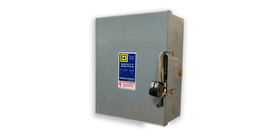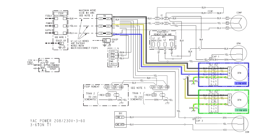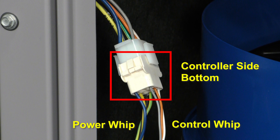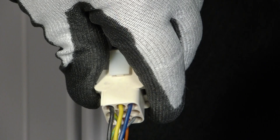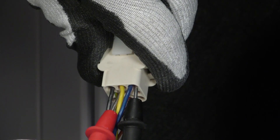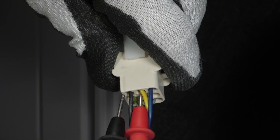Standing in a safe position, switch the disconnect to on. Whether the motor is three phase or single phase, it is wired across the line and should receive power whenever the disconnect is on. The plug connector has two whips which make the motor connections. Check for the unit line voltage at the power whip. Three phase motors will have black, yellow, and blue leads with a green-yellow ground wire. Single phase motors will have black and yellow leads with a green-yellow ground wire. If there is no power, troubleshoot back to the unit terminal block — the motor is not the problem.